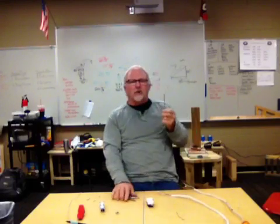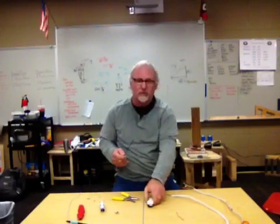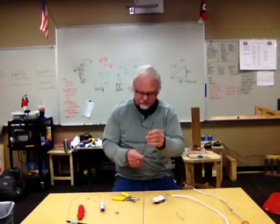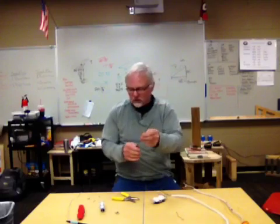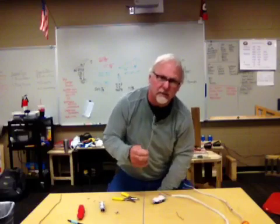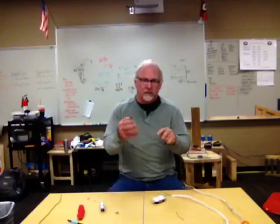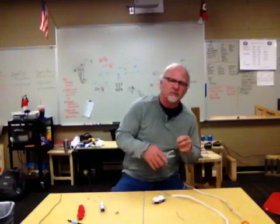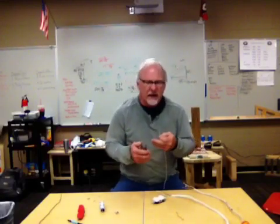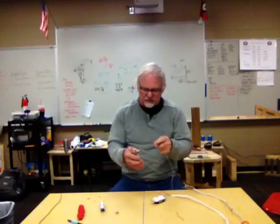This is the black wire, which you'll learn in one of the videos, is the hot wire. This carries the electricity to the outlets, to the switches. All right? So you'll do that with that one. I'm saying both wires just more for you to get a visual of the black and the white wires. The white wire, as you'll learn in one of the videos, is what we call a neutral. Electricity has to flow in a circuit, and the white wire or the neutral wire completes the circuit.